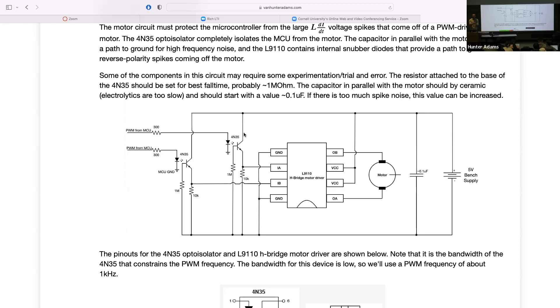In your CMake file, you can add a couple of commands to put a clock divider on that QSPI interface so you can slow it down relative to the system clock, which allows you to turn the system clock up even higher and maintain a connection to the external flash memory. There are also tricks you can do to tell the compiler that you'd like a section of code stored locally in cache, which can speed things up as well.